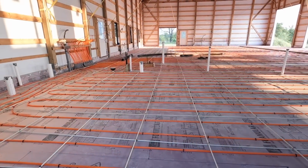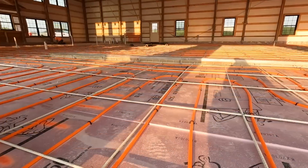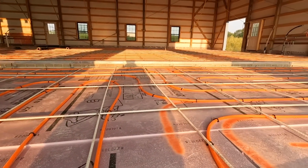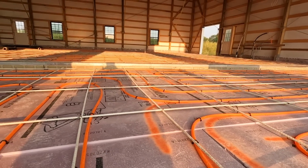We do have rebar in there. In all of our builds, we do half-inch rebar. The company I usually hire out uses the fiberglass rebar. We put it at 2 foot on center, and it works really well.